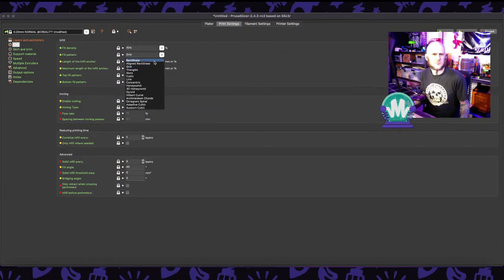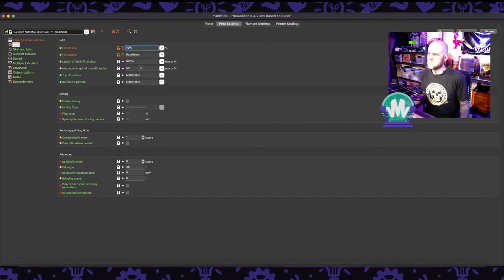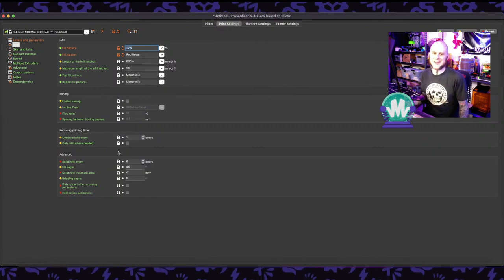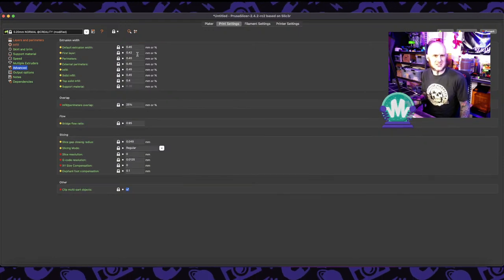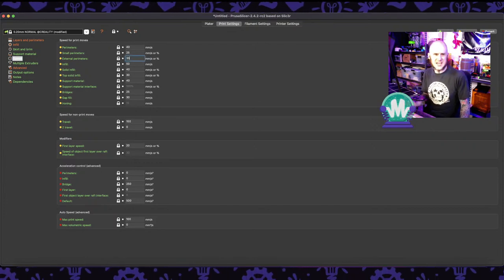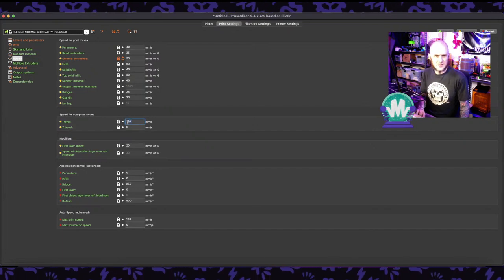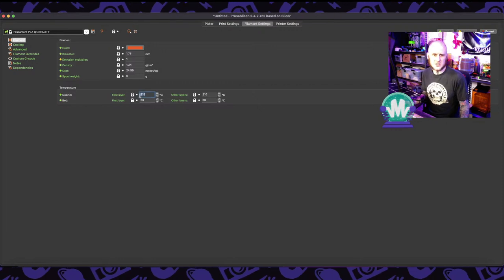Infill. Rectilinear, 10%. 250% benchy, I do want to do that, but not in this stream. Only retract on crossing perimeters. Advanced, we're going to do 0.5 on the first layer. Speeds, I'm going to keep the speeds pretty sane for the first one. I don't want to push this thing right out of the box, because I've not used it at all to know it, so...